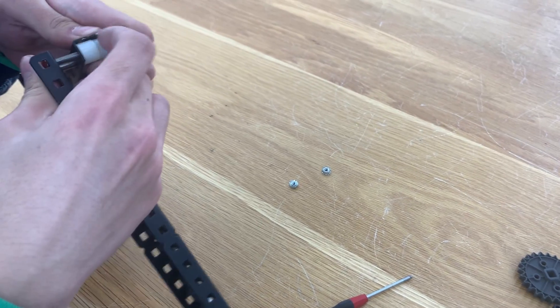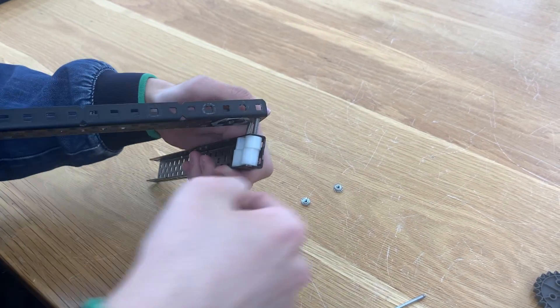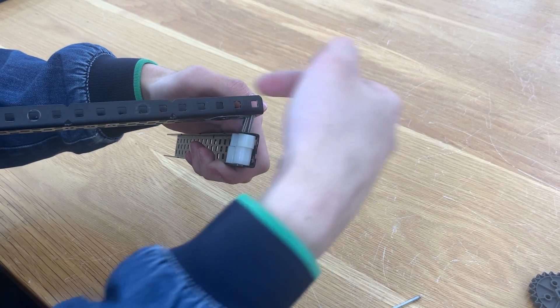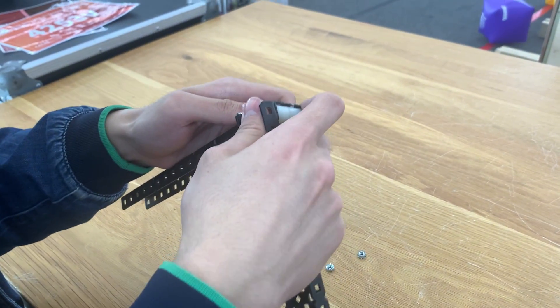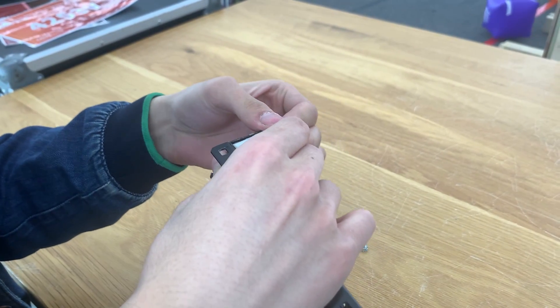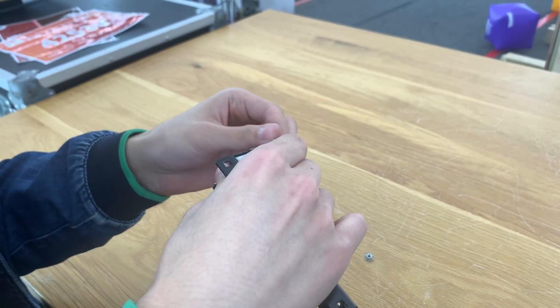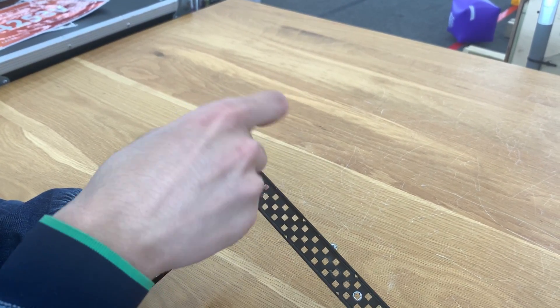It might take a little bit of effort because for these bigger half-inch spacers, due to how thick they are, the hole is actually slightly shifted to the sides. Then just screw it in. I'm using a kep nut here because I'm kind of lazy, but I recommend using thin nylocks for everything that's structural connections.